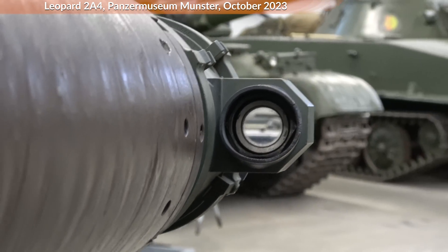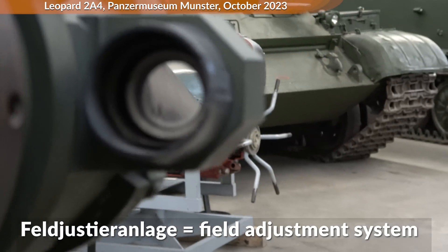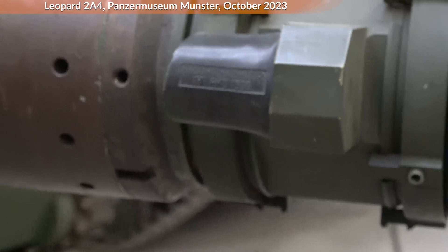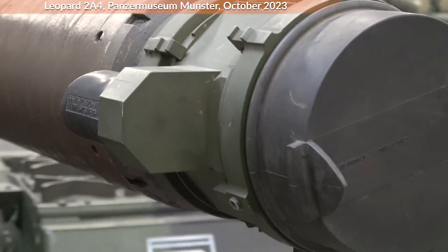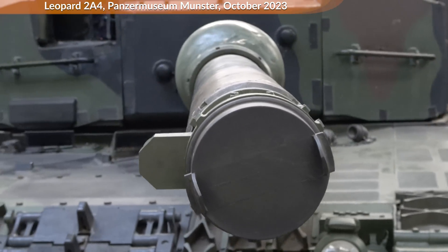So why is there a mirror on this barrel? This mirror is called the Feldjustieranlage, or basically in English the field adjustment system, and it's a major part of the fire control system. It's operated manually — not by the tank on its own. It's a mirror where you can align the gun sight to the barrel, and you can see if the barrel is drooping, because the barrel is a piece of steel under the influence of heat from cooling or heating up from firing. Depending on the temperature it tends to go down slightly. You fire three or four rounds, look into it, see the optic is not perfectly aligned, and you can adjust it.